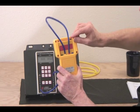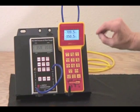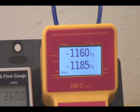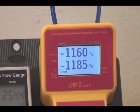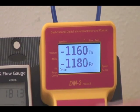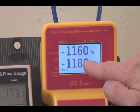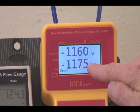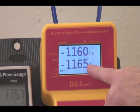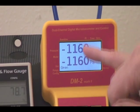By connecting those two ports together, it will take a little while for them to balance out. If there's some time averaging involved, it's going to take a bit of time to catch up — in this case it's one second averaging. Here we're out about 2%, then 1%, then half a percent, so we can tell that there's nothing in particular wrong with either one of these gauges; they're all performing just fine.